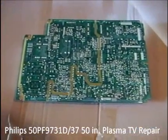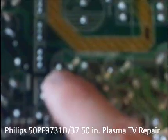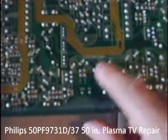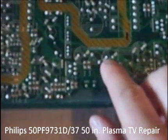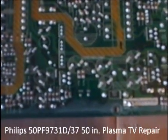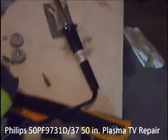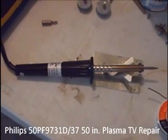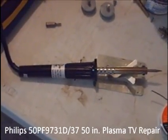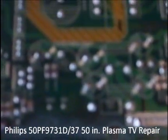Okay guys, I'm back. I already got the main board pulled. Zoom in here — you can see the backs of the capacitors that are bad right here and here. Now what I'm going to do is take my soldering iron and just touch these up a little bit to loosen them up and pull them out so I can take them with me to the parts store. I've got a soldering iron — a cheap one I bought at O'Reilly's, an auto parts store here around Kansas City, about seven bucks — and some soldering wire for when I put the new ones back in. It's got a real fine tip, so all you've got to do is basically just touch the tips of those after it's heated up and that should loosen it right up.